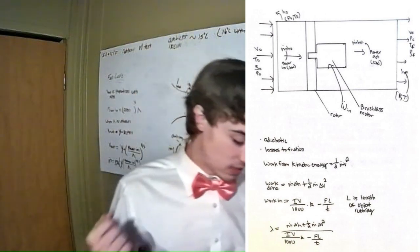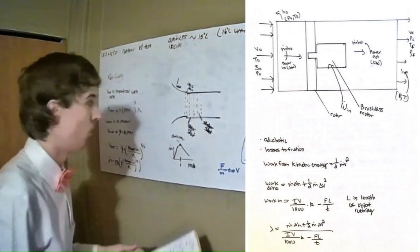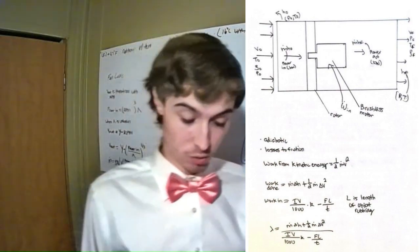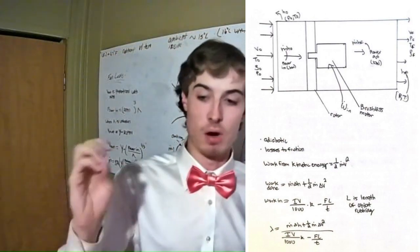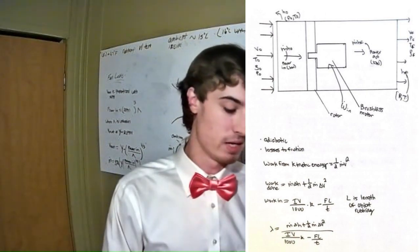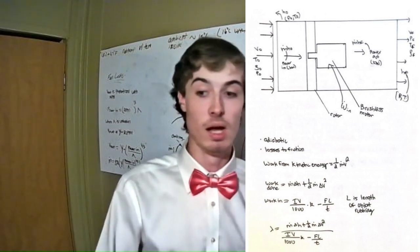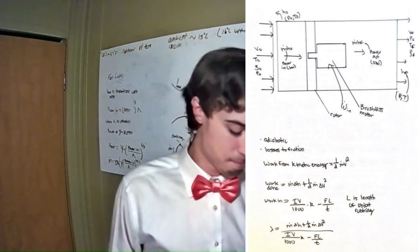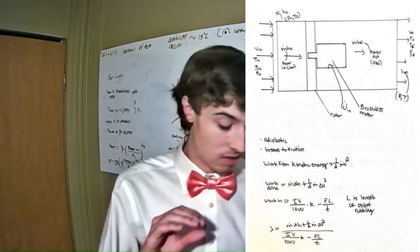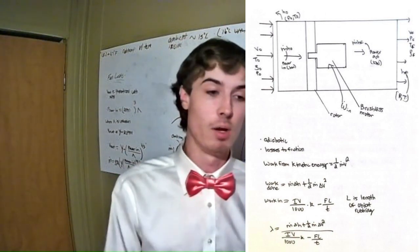So that's essentially what I'm getting. Just a little bit of math. And so the way I'm going to simplify this equation is by turning on the brushless motor without a rotor and running it all the way up through its RPMs with the different pressures and temperatures and velocities that I can do with the initial conditions. And I can make me a matrix that will have the initial power going into the brushless motor.